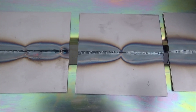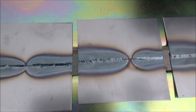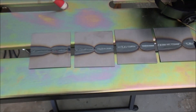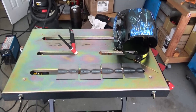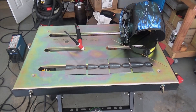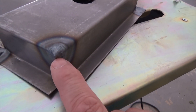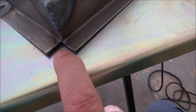These pieces are definitely fused together — they're not coming apart, so that's a good thing. I think as time goes on and I get more experience, the heat penetration will be a little less, and for instances where I need to be concerned about that, I'll get better. But for what I need to do now — welding this tray up — I really don't think heat penetration is going to be too big of an issue. I did really good right around through here, but then I burned a hole at the end.